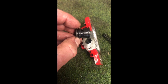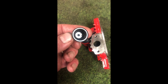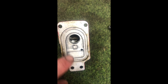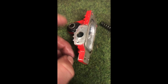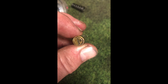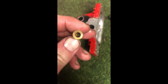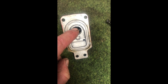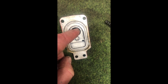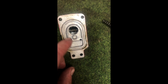When the brake is activated, that bar pushes in this direction and pushes this piston in against that seal, so the fluid that comes out of the hole isn't allowed to freely flow through this space here. Instead, the fluid is forced to flow through the piston. You can see on the piston there are some holes, so the fluid is forced down through there and through those holes. Those holes feed through here into this section, and in there is an adjustable orifice — basically a bit of brass with a hole in the middle that allows the fluid to travel through one of the orifices and back out the side.